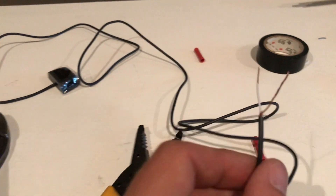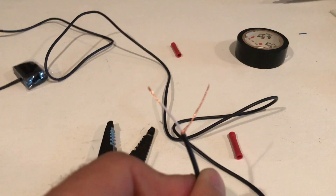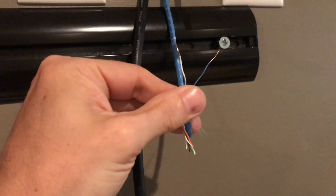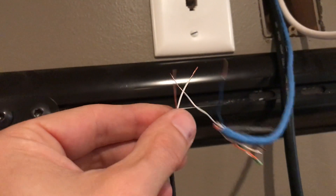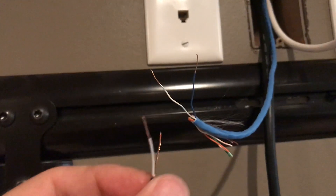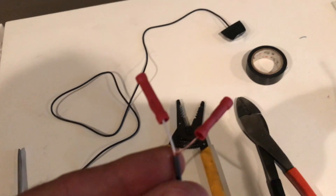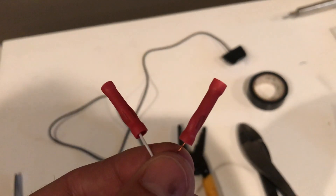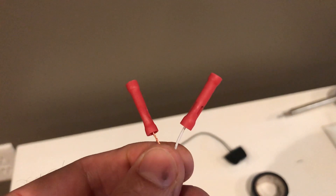One half is the IR part that will go to the TV. What I need to do is connect these wires to the Ethernet cable — it's super simple. I stripped it out and you can take any color combinations you want. I chose blue and white. Then all you do is run white to white, and then the copper to the blue. Make sure you do the same on the other side. I took some red butt connectors because the wires are real thin, connected one side here, one side there, and then connect it to the Ethernet cable.